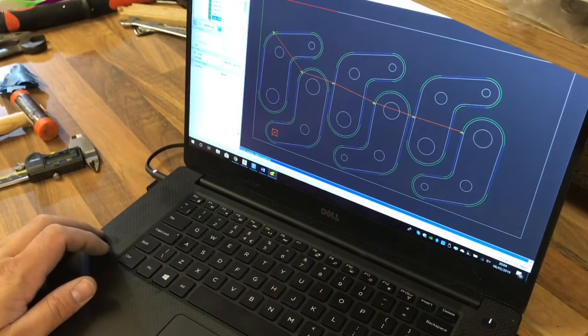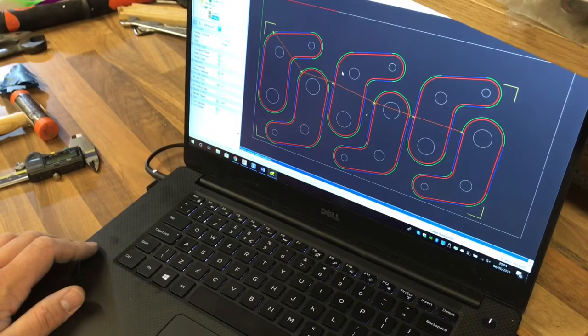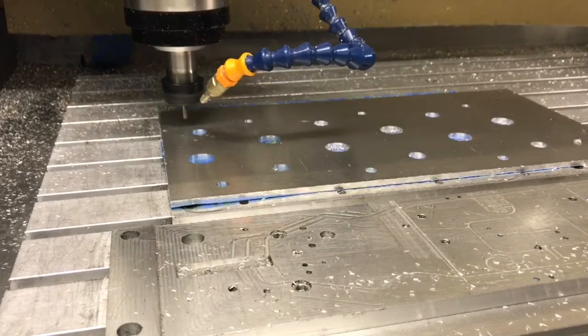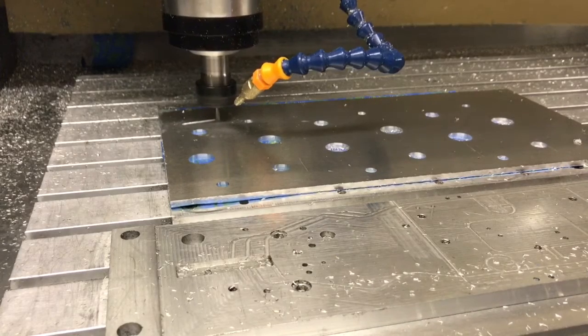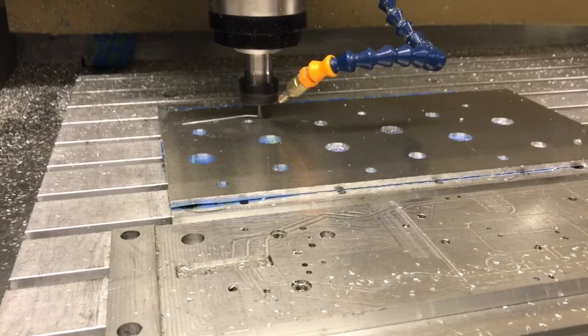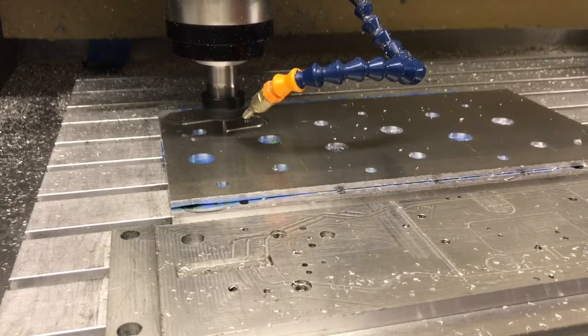As I'm happy with all the holes, I'm going to finish with that operation. So the next two operations - if we zoom in nice and closely - you'll see a double line. You've got the roughing pass which is the outside one. You're probably watching this because you're interested in DIY CNC. Then I'll come back and do a 0.1mm finishing cut - just a nice finishing cut. You can see the air is doing a nice job of blasting the chips away, and I've got a bit of lubricant on it to keep it nice.